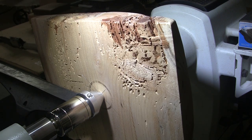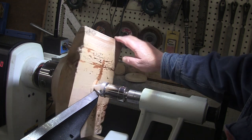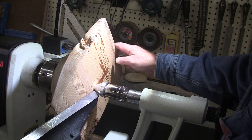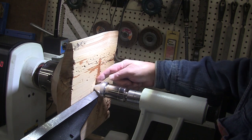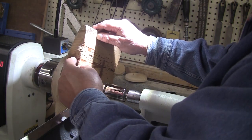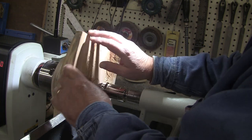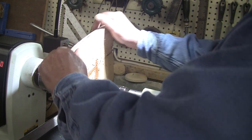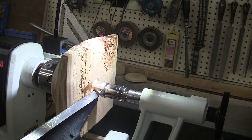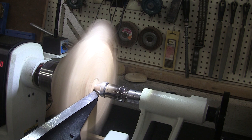We'll see you back here — don't go anywhere. I've got a pretty good crack going through here and I filled it with CA, which also ran down this way and comes almost halfway through the piece. There's no wiggle to it. I'm hoping that sticks with us. I'll get my mask and face shield on and grab my freshly sharpened 5/8-inch bowl gouge. Turning at about 780 RPM.